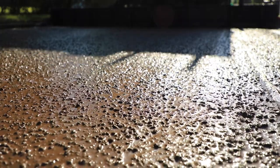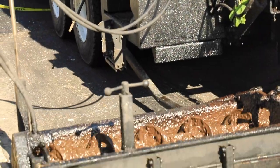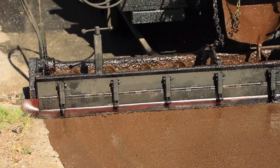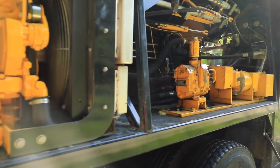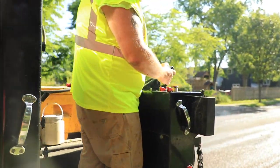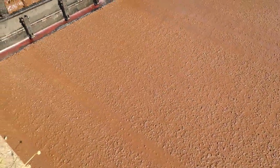It's a preventative measure, so the engineers and myself go through a list of streets and pick some to work on. We try to get on streets three to five years after they've recently been paved — that's when surface cracks start to appear. If we can get this material on before a bunch of surface cracks happen, we get the street sealed up. It's a giant preventative measure to help prolong the life of the street.